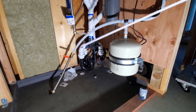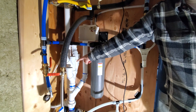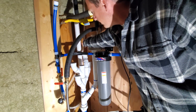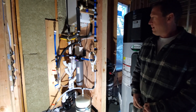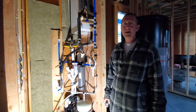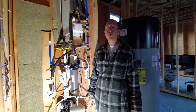Coming out of the top of this valve are the branches of the tree. One arm connects over to the laundry box. All the other fittings handle condensate — there's a line from all the HVAC systems, and both water heaters produce condensate that feeds into one of these. There are also connections for overpressure valves and a drain for the sprinkler system. The plumbing rough-in is done; we still have some electrical to finish, so stay tuned for next time.